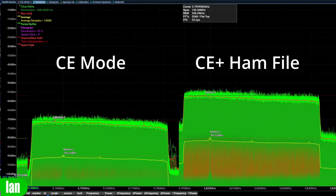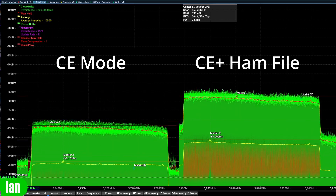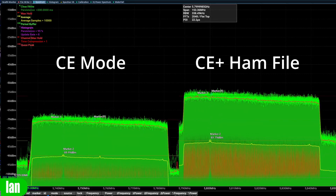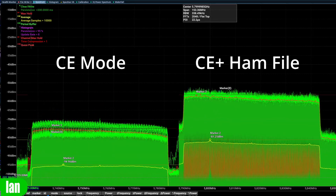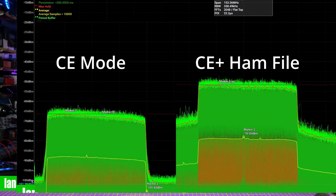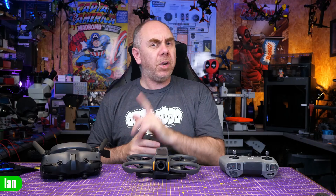I have triple checked this and I can confirm that the HAM file on the SD card of the goggles will open up additional RF power and basically push it into the FCC RF power mode. What is interesting though is that it isn't exactly the FCC RF power mode — it is an increased RF power output, because in FCC regions the DJI Avata 2 only works in either 2.4 or 5.8 GHz.